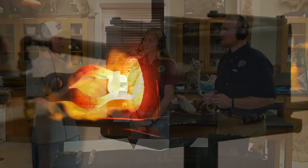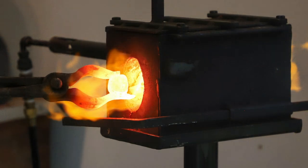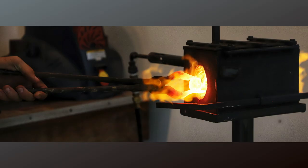It's very small, and it's called a single brick forge because they take fire bricks, which is what's used to make it. It's about the size of a cinder block cut down the middle. It just has that one little hole, but it's super fire retardant. Then you have a blower that goes in the side, and as your propane goes down this tube, it has knots in it that make it take in oxygen at the same time. So it mixes before it gets to the forge, and that's where it heats up. Gets it really, really hot.